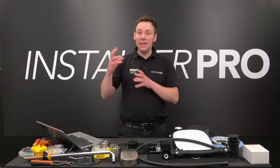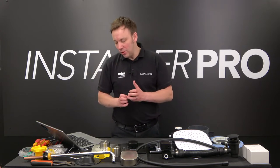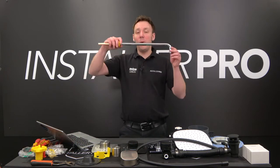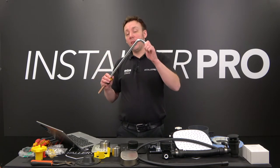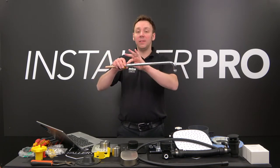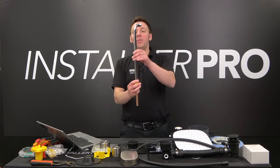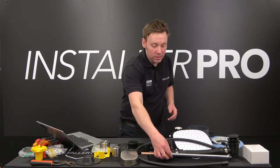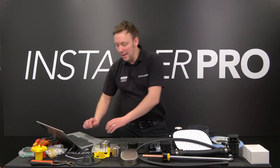Some of our ceiling fed digital mixer showers, the Mira Activate, which I mentioned a little bit earlier, does have a deluge bar similar to this, which can actually be cut because it comes with the half inch thread on both ends. So if you want to use it as a rear fed, you just chop that piece off. If you want to use it as a ceiling fed, you can chop the curve off as well. So there are options available to you if you want to purchase another accessory for it and do a ceiling fed as well.